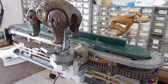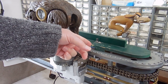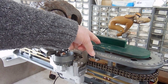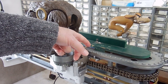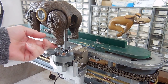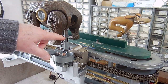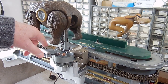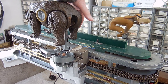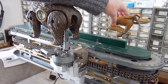Here I've added a portion of the scenery. It actually serves a function in the animation of the animals as well. It's got these little trip wires — basically a piano wire that sticks straight out, coiled around a screw and then locked down so it always points in the same direction. A lot of games have had operators substitute a metal bar to go across here, as these piano wires have a tendency to break over time. The bad thing about that is it has no give to it, so it's really hard on the bears and the dog — often times you'll see the bottom of the feet of the bear extra worn because they're dragging across that bar. The front legs and back legs are both pivoted and connected by a cross piece, so when this one goes backwards that one goes forwards. As they go across and get tripped by these wires, their feet move and lend some animation. The dog as well will trip and make it look like he's running.